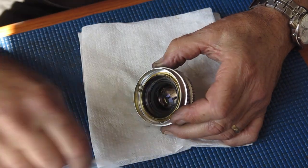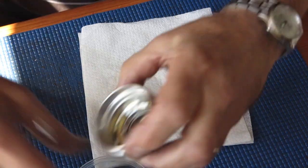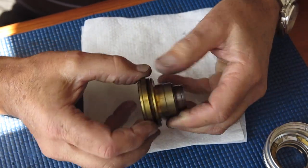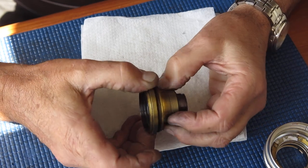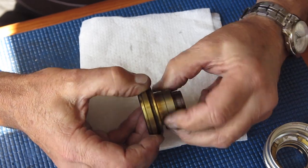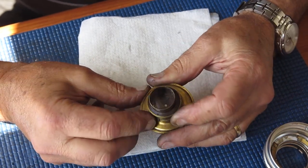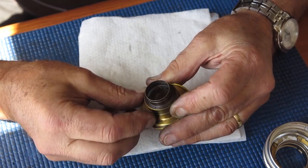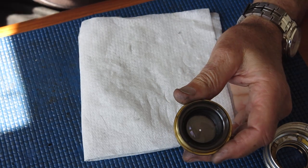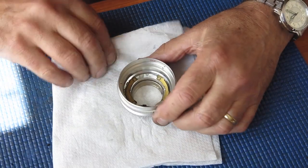With their washers, tip those screws out. The lens capsule fell out. You can see here — this is where the lens actually focuses. That's the helical. The lens moves in and out of the body of the lens at that point. That's not too stiff. I'll clean that grease and get rid of it. I'm checking the diaphragm action here — that's actually quite snappy. I'm looking at the blades and they show no oil contamination. Our problems with this particular lens lay elsewhere, obviously.